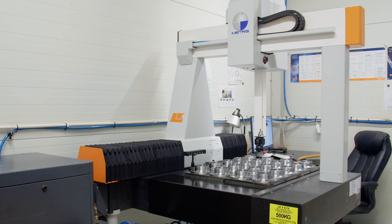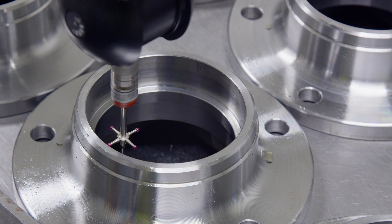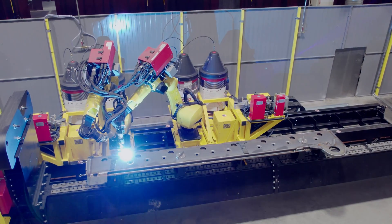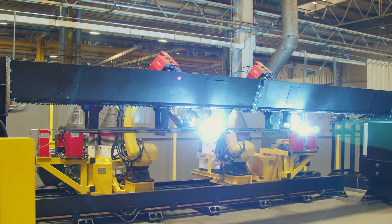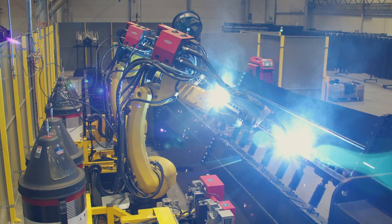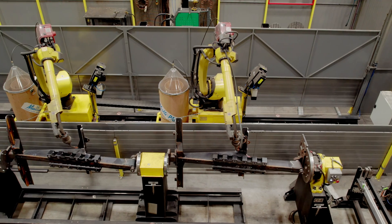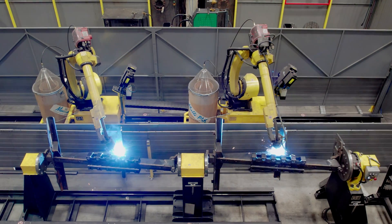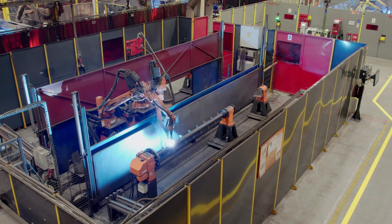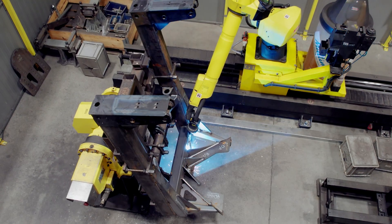Already at this stage, the parts are inspected in the measuring chamber. All dimensions are verified on the coordinate measuring machine. Time for welding. Robots operating in the twin technology using two torches start their work to weld together components of the cutter bar. Swivels, supporter arms, conditioner shafts and suspension frames for the front mounted mowers included in the Gigacut set are welded on the next six robotic stations.